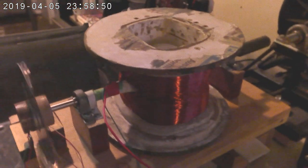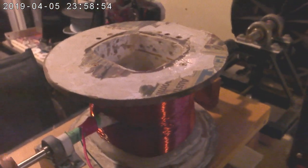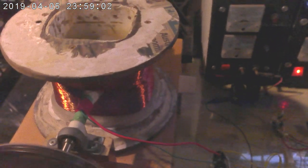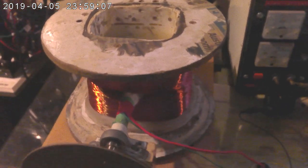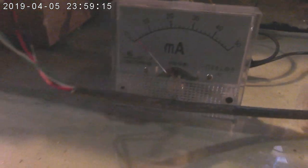I've taken it from 1.4K ohms, then brought it down to 1,100 ohms, and now it is currently sitting at about 800 ohms. Every time I do that I bring it closer to a conventional motor. So currently it's running at 400 volts and about 2 to 3 milliamps — so about 1 watt.